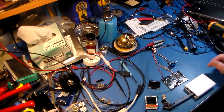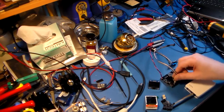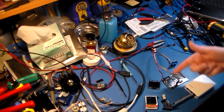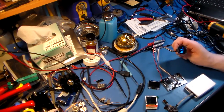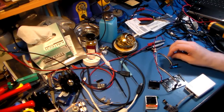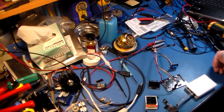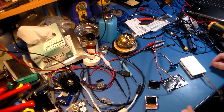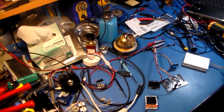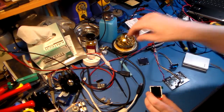I'm stuffing 14.5 volts into it. It's 60 milliamps for this whole thing, so the voltage regulators aren't breaking a sweat, because the microcontroller and the display just simply don't draw enough to make it a problem. Nor do any of the external peripherals on here. So anyway, I've got to return this to the other bench and pretty much be done with this, put this in a radio and move on.